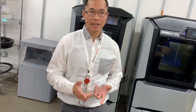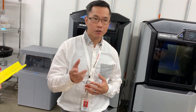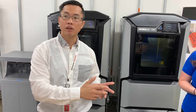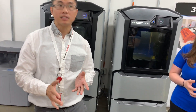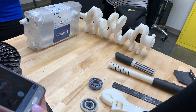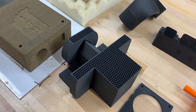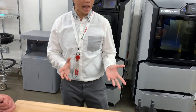We've done a lot of honing trials and spray samples. We printed a full bumper corner because styling had some ideas for very radical shapes, but in paint we can't paint everything — we have restrictions on our materials and technology. Now we bring it here and we can test the shape at a much quicker rate, rather than waiting for a typical 12-week lead time. We could do it in maybe less than a week. It's all about putting in less lead time and cost to get that feedback faster to our design team.